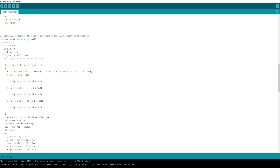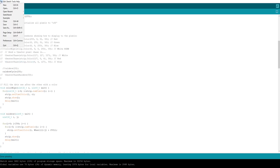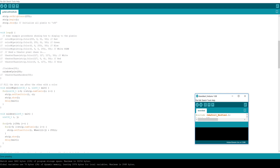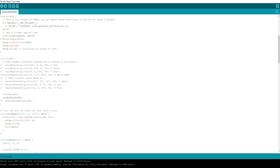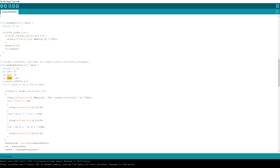So this is the code for the LED guitar, but only using amplitude. I just took the Adafruit NeoPixel code — if you go download the Adafruit NeoPixel library and go to examples and click on strand test, that's the file I used. I modified it to work for my purposes. If you go to the main void loop, you'll see there are a bunch of different modes built in by default. I only chose to use the Rainbow Cycle one because that's the coolest. Then we go to the Rainbow Cycle method. Here we have three variables indicating lows, mids, and highs — for when I do frequency analysis. Right now I only refer to the first, second, and third LED strips, but it's the same thing for now.